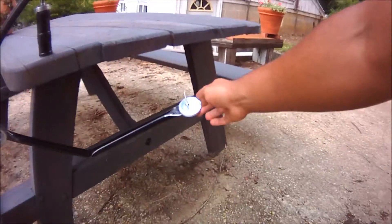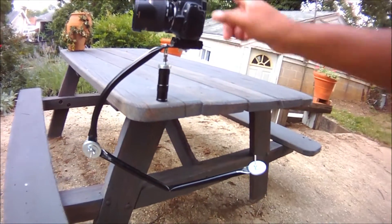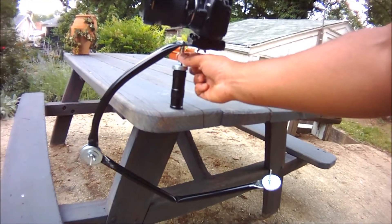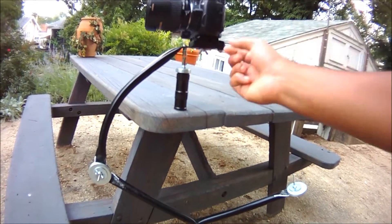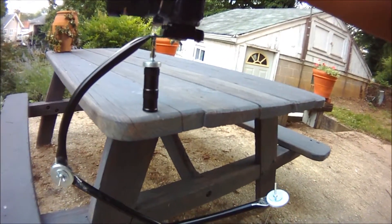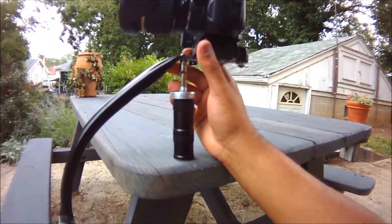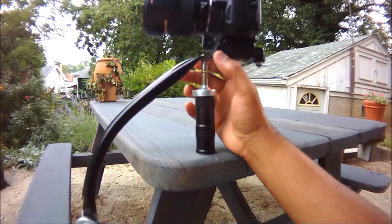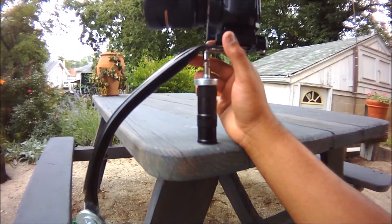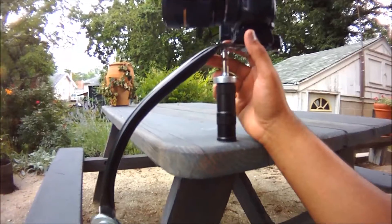As you can see, I'm using washers for weights in the front and in the back. These washers don't equal the weight of the camera, but since they are so far away from the hinge point, they act as a cantilever and the effective weight is increased because of that. For my pivot point I have a u-joint that I bought on eBay from a hobby shop. It's a steel u-joint, pretty small, but it can definitely take the weight, and I got it for about six bucks.